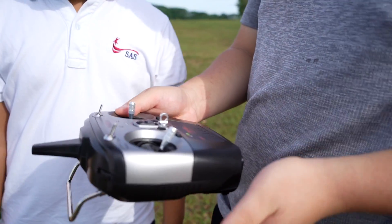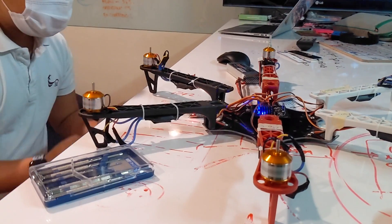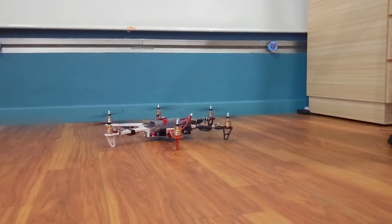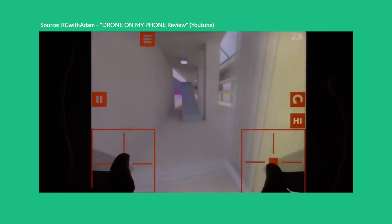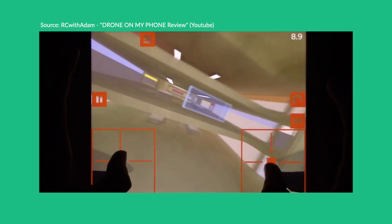We were then blessed with the opportunity to connect with Jason, an alum from our school who is also an avid drone hobbyist. It was time to test if the drone worked. We first tested the motors after the receiver and transmitter connected. Next, we tested the motors again with the propellers and then did another test to see if the remote's configuration needed to be corrected, which it did. After a few more tests, we had our students use drone simulator apps to practice flying, but had them turn off stabilization because our drone did not have gyro stabilization. With two weeks of practice, our team got pretty good at flying without stabilization.